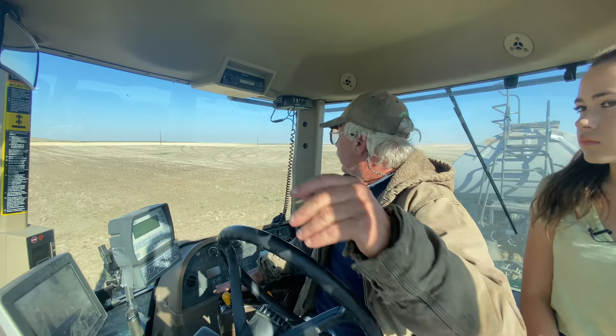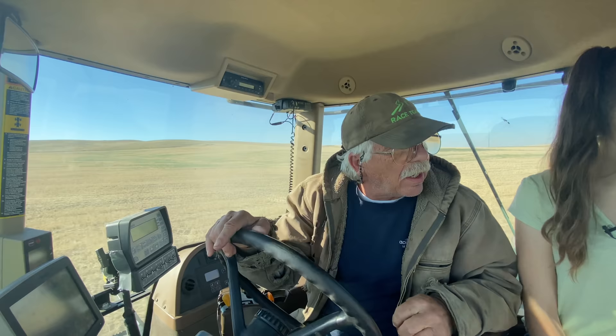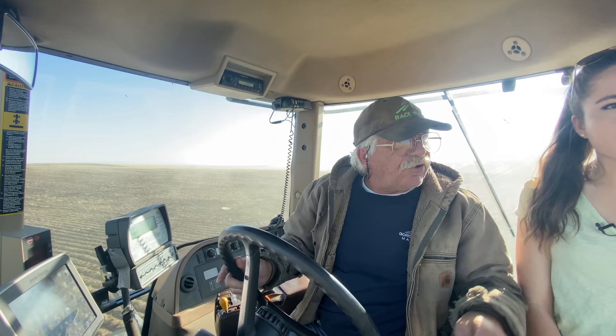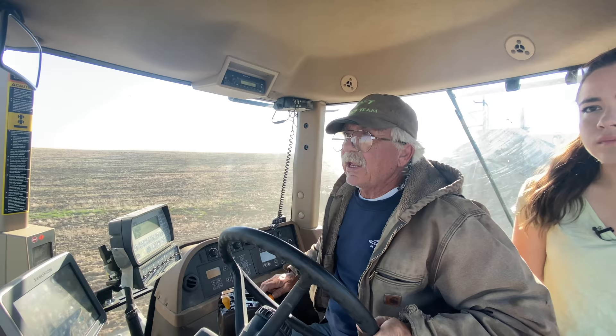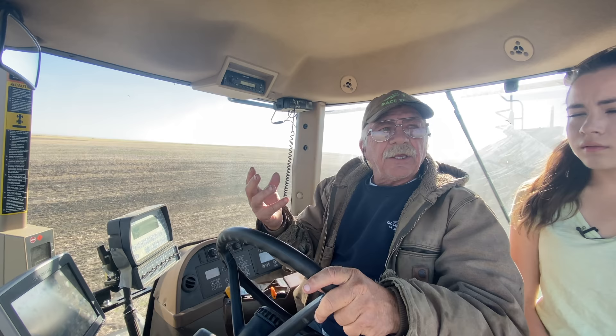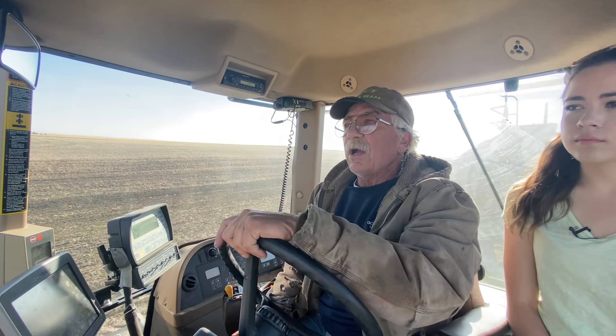I'm going to lift it up and turn and get away from the post. You're always looking at your implement — you can't get brain dead. So we're going to roll in and shoot high points on this second pass along here. As soon as you get this thing not backing up and going forward, it will sink the plow back in. We're just going to keep biting this off until we can get some places where we can turn around and shoot a straight pass. You have to run this a little bit to get it perfect.